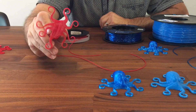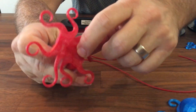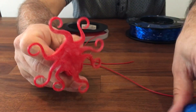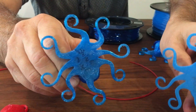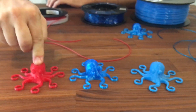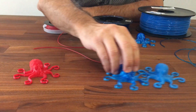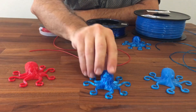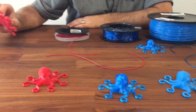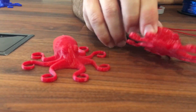I had some delamination on the underside of the NinjaFlex between the outline and the border. Maybe I have to increase my overlap, or maybe I didn't have the first layer right — that did not happen on the other pieces. The NinjaFlex is amazing, but I had to slow down the print speed. On both of the others I was able to get 50 mm/s; on the NinjaFlex, 35 was the max, and 20 was really perfect. At 35 I had a little bit of zits.